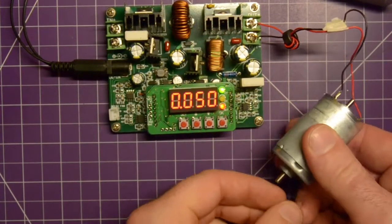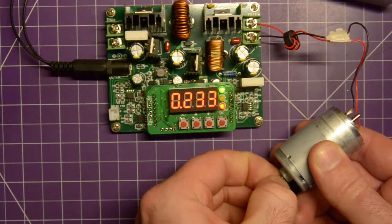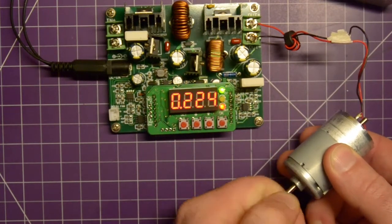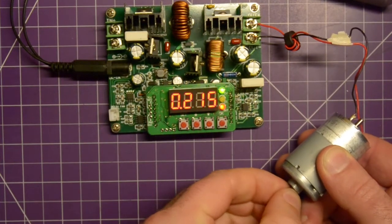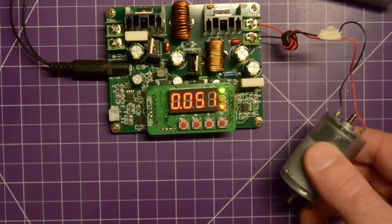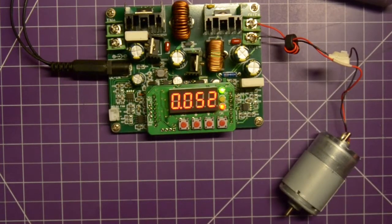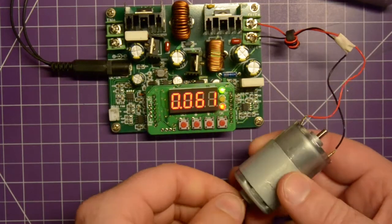That's basically nothing on a big ship really. Let me see if I can slow this down with my fingers - I'm getting like 300, 300 or so milliamps there, almost 400. So like half an amp. Half an amp at 12 volts would be 6 watts - 6 watts is plenty.